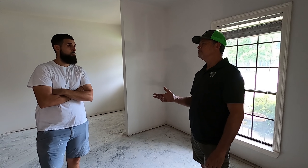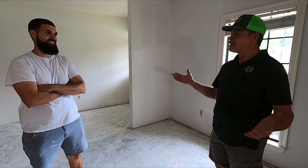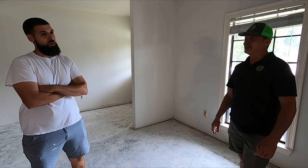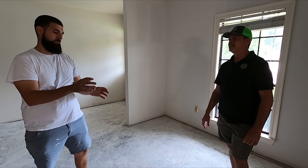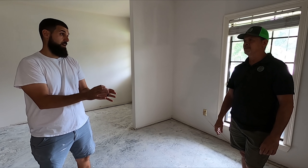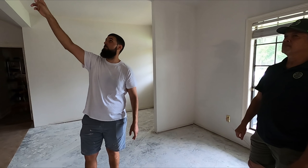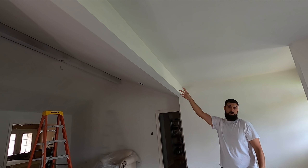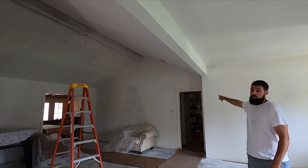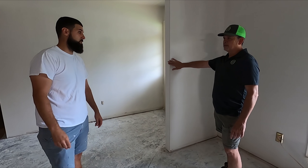We talked about another project where you set your corner bead with a laser — did you use a laser on this one? No, because the framing was perfect. We set the framing with the laser, so there's no need. As long as I'm keeping my clinch square and then shoot it with one-inch crown staples afterwards — everything in here was shot both sides. The bead you see up top has mesh tape — that's the only thing we use mesh tape for, fiberglass tape, on both sides running. And the tops up and down have mesh tape on them also. So your outside metal corner bead — you clench it on and then staple it. Correct.